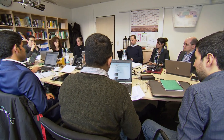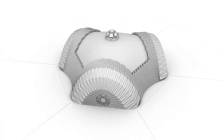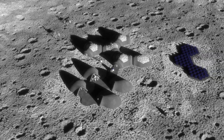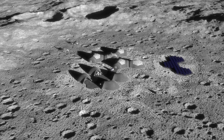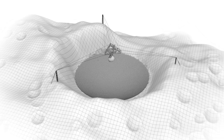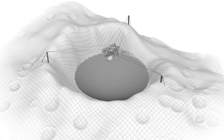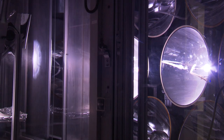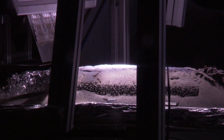An important part of the project was to develop lunar-based scenarios to define requirements for different applications. Scenarios include the description of how a basic lunar outpost can grow into a settlement within a given timeframe, and what kinds of building typologies and structures are used — including non-pressurized shelters for vehicles or equipment, pressurized shelters for habitation, a launch pad apron to prevent dust, terrain leveling for a telescope on the far side of the Moon, and surface pavement for roads and pathways. Our goal is to find structural topologies that fit these different scenarios.